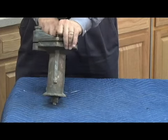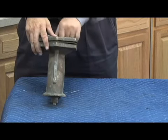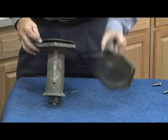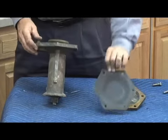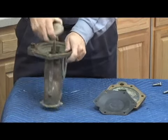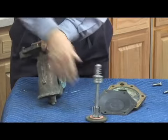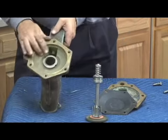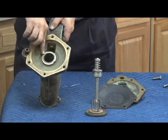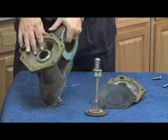Go ahead and remove our relief valve cover bolts. There will not be spring tension underneath on the 2.5 and 3 inch. There will be a small movement of the cover, as you see, just like that. Cover comes off first, then the relief valve diaphragm, and it exposes our diaphragm retainer. By grabbing the stem in one piece, it'll come out just like this. Relief valve seat stays inside the body, can be unscrewed as there are 2 little legs on that side. Take a little driving rod, can unscrew if you have to change the relief valve seat. Average repair, it doesn't have to.